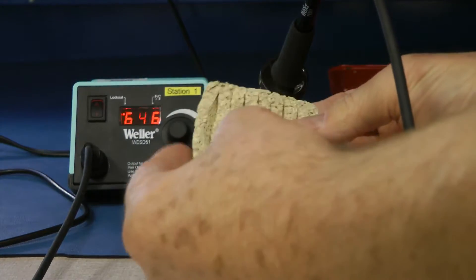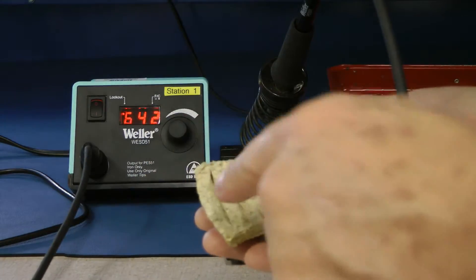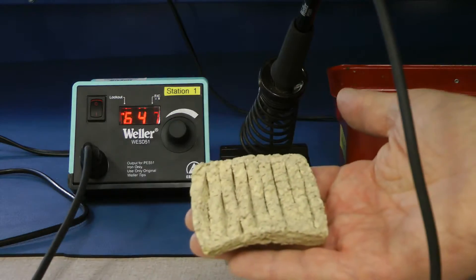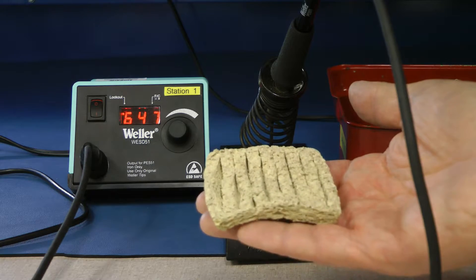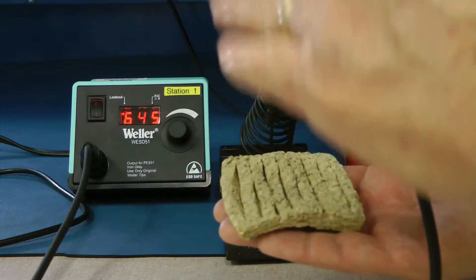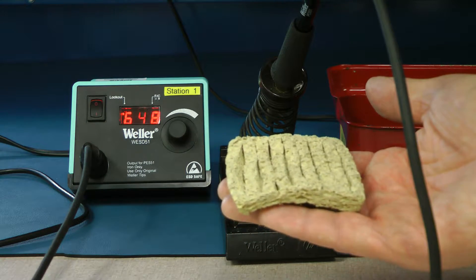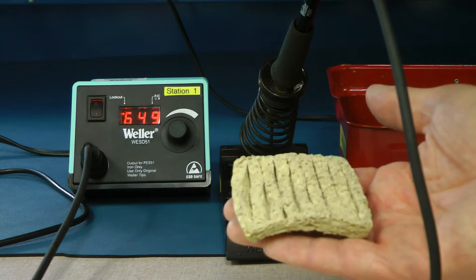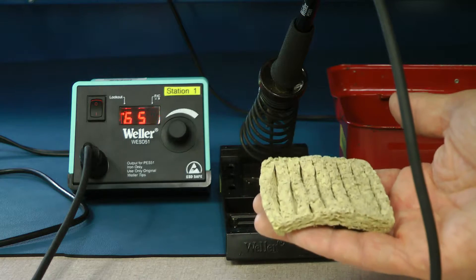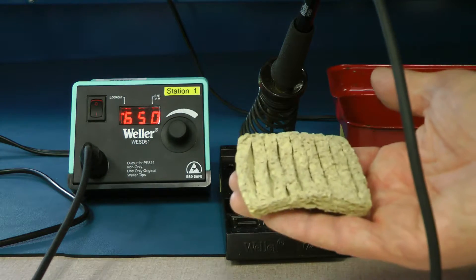This sponge is not wet but it's rather dirty. When you're wiping the soldering tip on a sponge like this you're going to be picking up flux residue, and it'll heat-sink the soldering tip if it's too wet. Keep these soldering sponges clean and without flux residue build-up to prevent rapid oxidation of the soldering tip. Oxidation does not transfer heat properly, so keep the sponge clean.